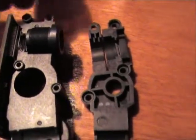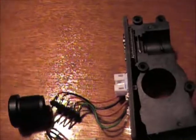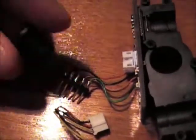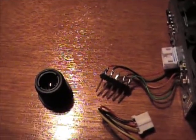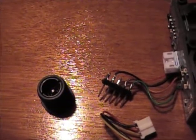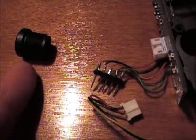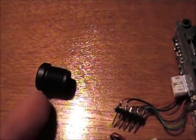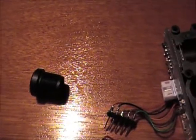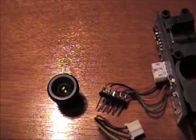The imaging part is pretty interesting. The first part is the lens — from some research there's a company called Sunex, S-U-N-E-X dot com, that makes lenses. I took it all apart: you can unscrew this little piece from the bottom. There are three lenses inside — two plano-convex and one that's concave on both sides. The first from the front is a plano-convex, then a little tiny spacer, then the double-concave lens, then another spacer that's a little thicker, and another plano-convex lens. Measurements-wise, the casing seemed to fit with a 12mm lens that they have.